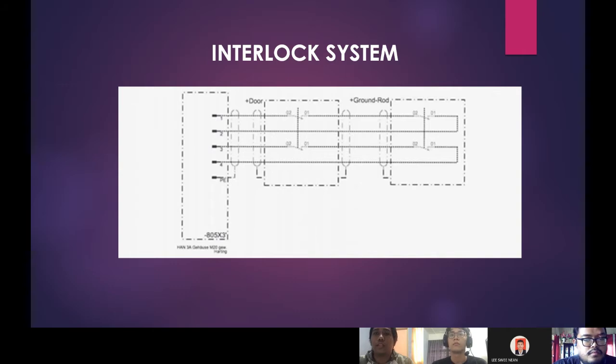The interlock system is used to monitor the door to the high voltage part of the system and to monitor if the ground rod is taken out from the high voltage. It can also be a door in a safety fence mounted around the HV part. You can use the delivered Harting plug with 6 pins to connect the interlock. Take care that two normally closed contacts are used together. The interlock works with dual channel operation, so it will monitor the discrepancy time between the two contacts, and it has cross-short detection to prevent connecting the two circuits together in a fault case.